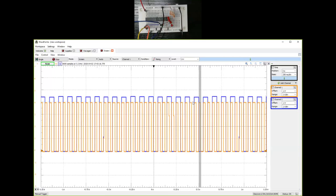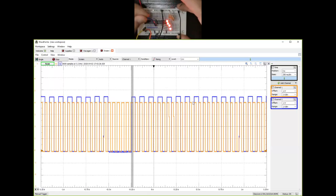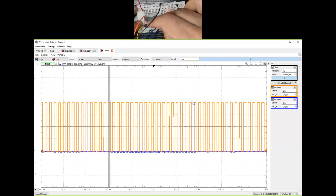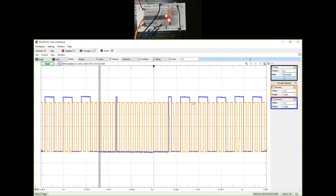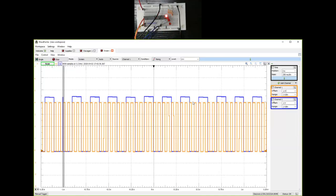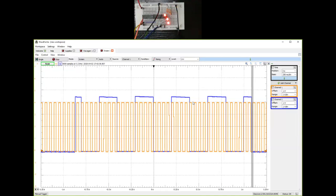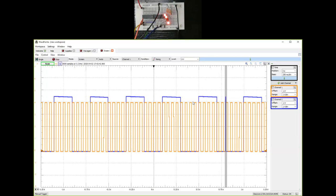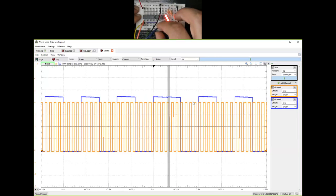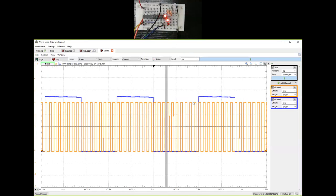And we can take a look at that very easily by simply moving the channel 2 pin to pin 4, 5 and 6. And in waveforms you should expect the frequency to get slower and slower and slower. So I'm moving one level up and you can see that the frequency slowed down a bit. In fact it got halved. If I move it one level up further, it got slower by half again. And the fourth most significant bit, it got slower again.